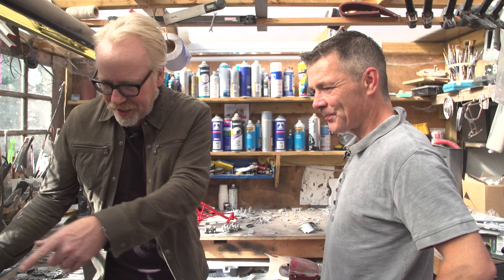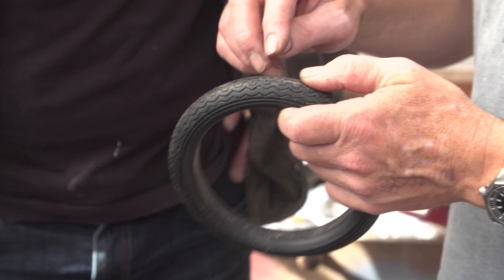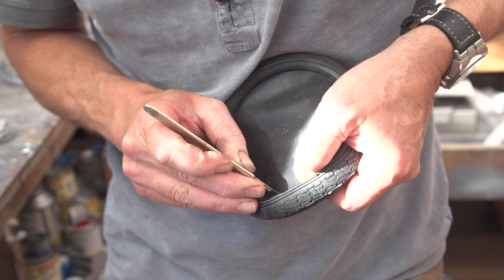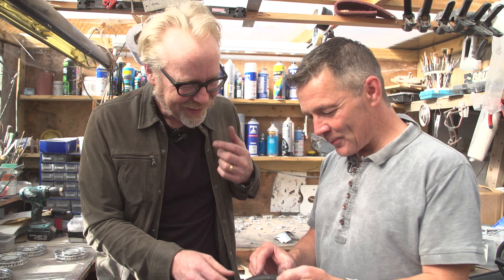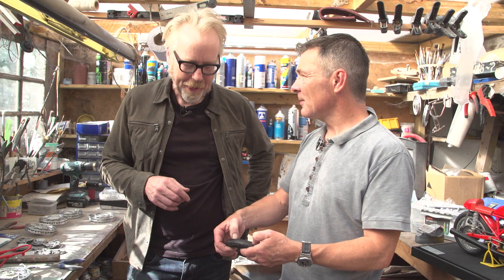This is your tire master — yeah, I turn that up on a lathe. How do you do the treads? They're difficult. The lines go in on the tread, but obviously the tread pattern and the zigzags — I did that with a chisel. Just sat there with a chisel. You only have to do that much; you can do it in half an hour a day, and by the end of the week you've got it done. Then you cast them in rubber.